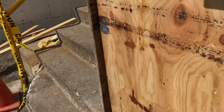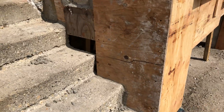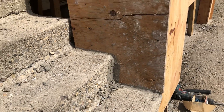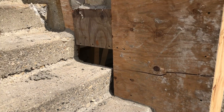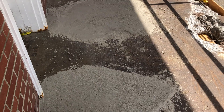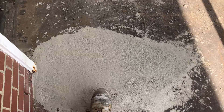Some of the places you can see where there were gaps or holes in the forms, we just used the TF Structural to fill in those gaps. You can see it here — this prevents any material leaking out of the forms as we pour it. It sets really quick, and when the forming process is done we can just chip that right off and you're ready to go.